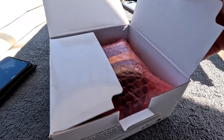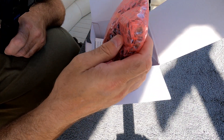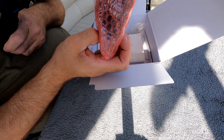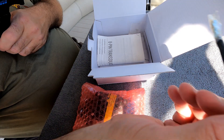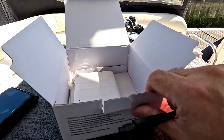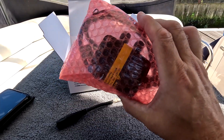What I have here is a 6-pin transducer to 8-pin sounder adapter wire block. In the box there's a terminal block that's going to allow me to connect the devices together, and this is the latest version so I can put more than one thing into this box. What's also very clever is that I've managed to keep the lead left over from the old Garmin lead, which has the six-pin plug and tails on it. So rather than cut the transducer cable, I can use this to attach to the transducer cable once I've wired it into the terminal block.